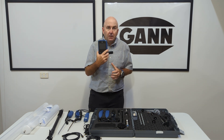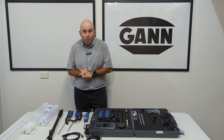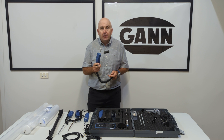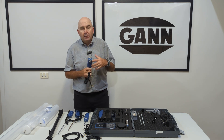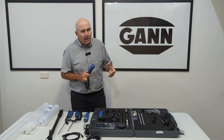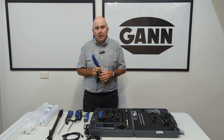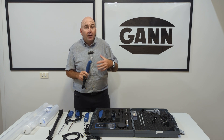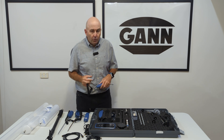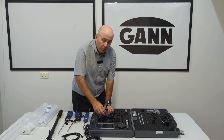The best moisture meter I have ever seen in the industry and I've been in it 30 years. So what comes with the kit? The first thing we've got is our BL55 — this is our dielectric ball meter. It's fantastic for non-invasive readings for concrete, mixed plaster, limestone, and mortar. It also does weight percentage, calcium carbide equivalent, and has a relative scale. It has lots of settings for your building materials and goes four to five centimetres maximum into your building materials.